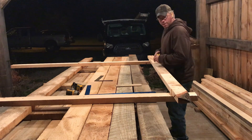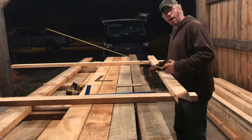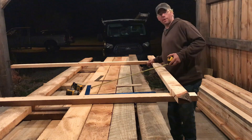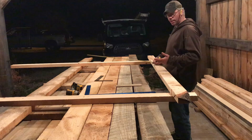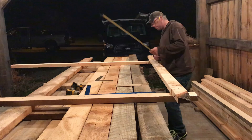That wind is whipping tonight. So I take my measurement, I make this the corner — this inside corner here is going to be the inside of the right triangle. I get a couple of stretchers across for stability, screw them into the pile for stability so that when I set my rafter stock on there I'm not tipping this thing off. I start with one in the middle and one in the corner, then I square this up. I'll get it close to square with my framing square, and because this is such a short triangle I do the 3-4-5 — that gets you your right angle. Six-eight-ten also works — anything that satisfies your Pythagorean theorem gives you your right triangle.